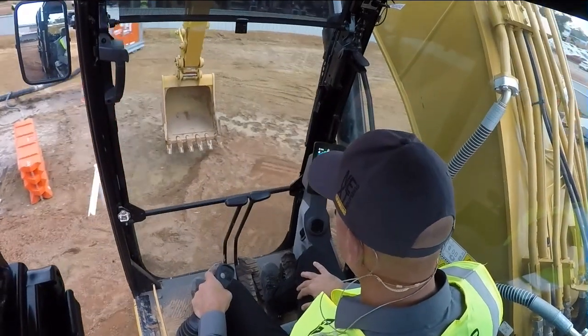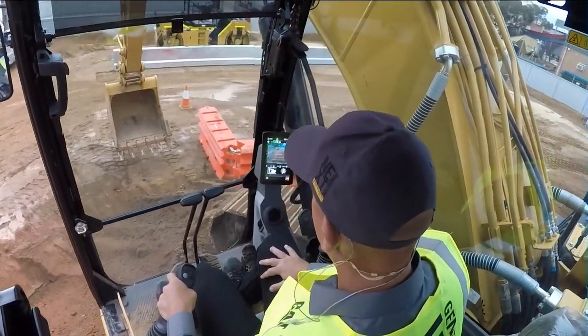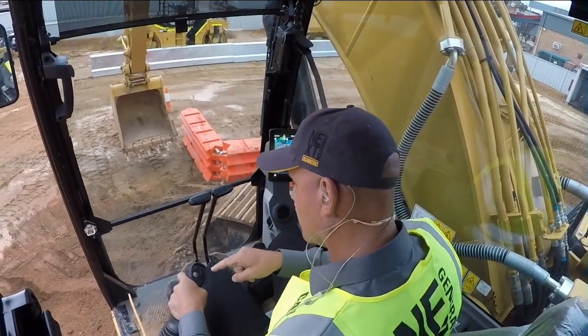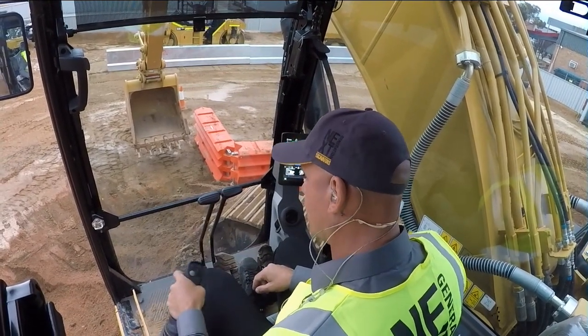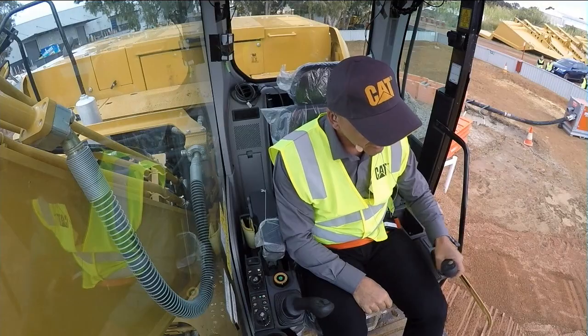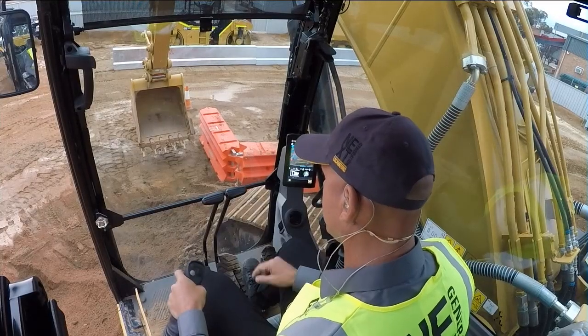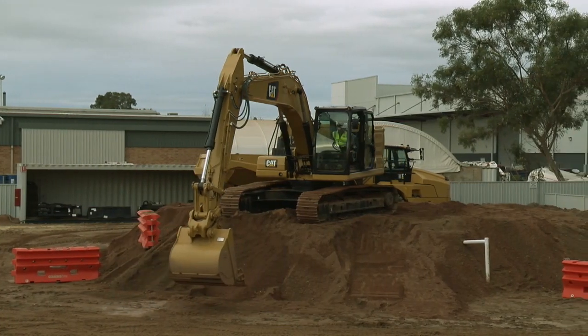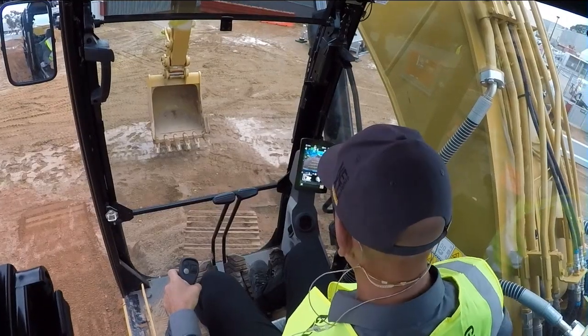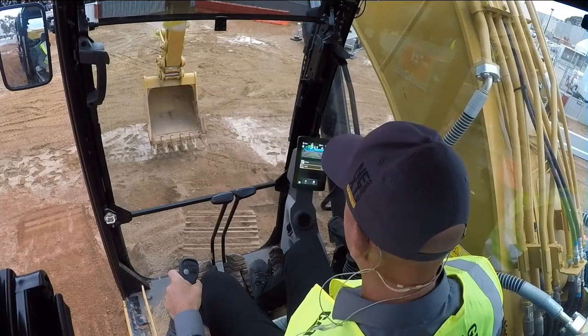Let's swing across and see if we can hit this wall. As you can see on the monitor, I've still got my left joystick slewed as far as I can go — I cannot hit that wall. Hopefully you can see on the monitor that I'm trying to pull as hard as I can. 2D e-fence right. Let's swing to the middle here, and I want to set what we call swing assist left, so you can see the difference between the e-fence and the assist.